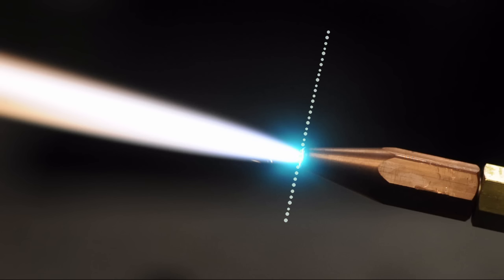What's happening is there's a flame front — the flame is trying to burn its way up that gas. Sort of like when you light a fuse and the fire runs up it. The flame isn't moving because the gas is coming at it as fast as it's trying to burn.